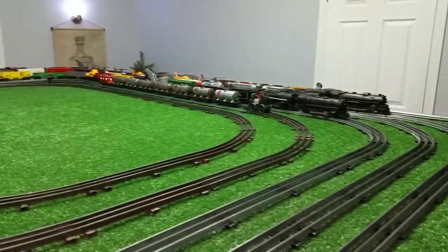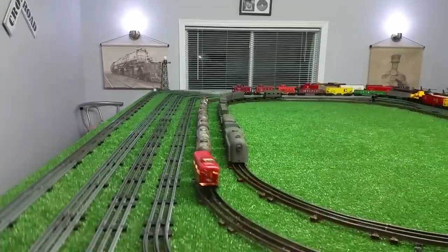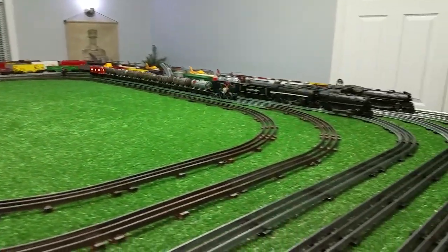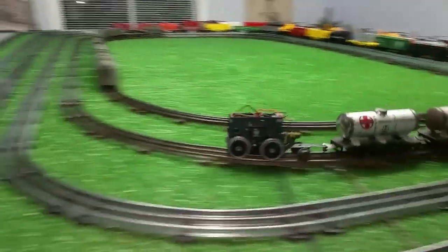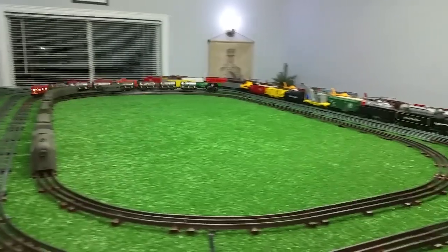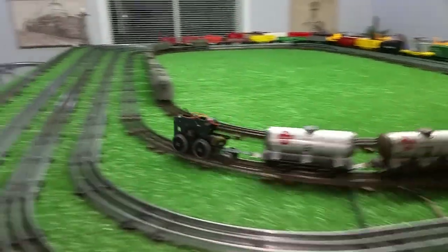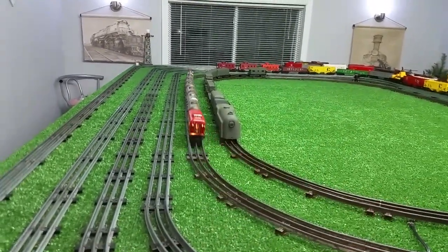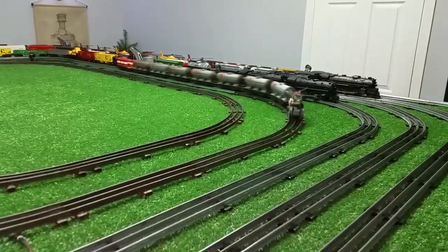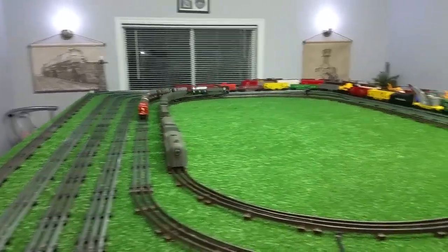Always fun to see what you can make out of junk. And in this case, I could put this right back in a Lionel body and reassemble a working locomotive. And like I said, add a couple of diodes and just put it back on the rail and run it. Right now it is straight DC because it's using a CAN motor. But as you see, that runs really well. So this would actually be a great way to set up a portable track where you could actually run it on a battery.